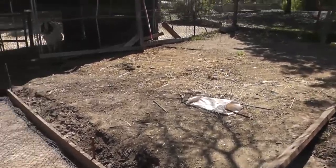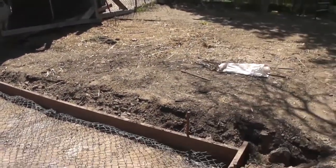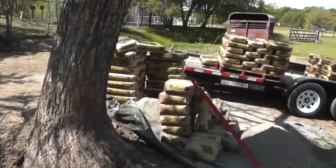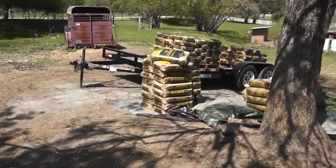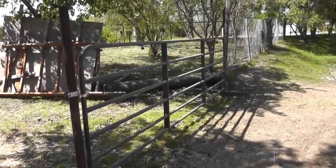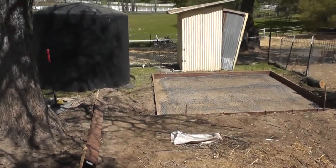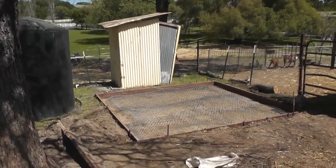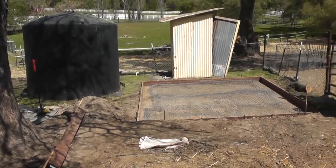Now, cost-wise, getting a truck to come out here and dump it in here would have been slightly more, barely a little bit more. I would say definitely worth the money, because the effort it's going to take for me to mix that and dump it in there is going to be significant. But I just didn't want to deal with the 5-minute per yard timeline on the truck and then trying to squeeze it in my gate around this corner through this 12-foot thing, dealing with the tree height and the length of the boom to reach the thing. So it just seemed a little bit more stressful. And yeah, this is the way I chose. But if you're doing anything bigger than this, I highly recommend using a truck. Anything smaller than this, then you probably want to mix your own bags.